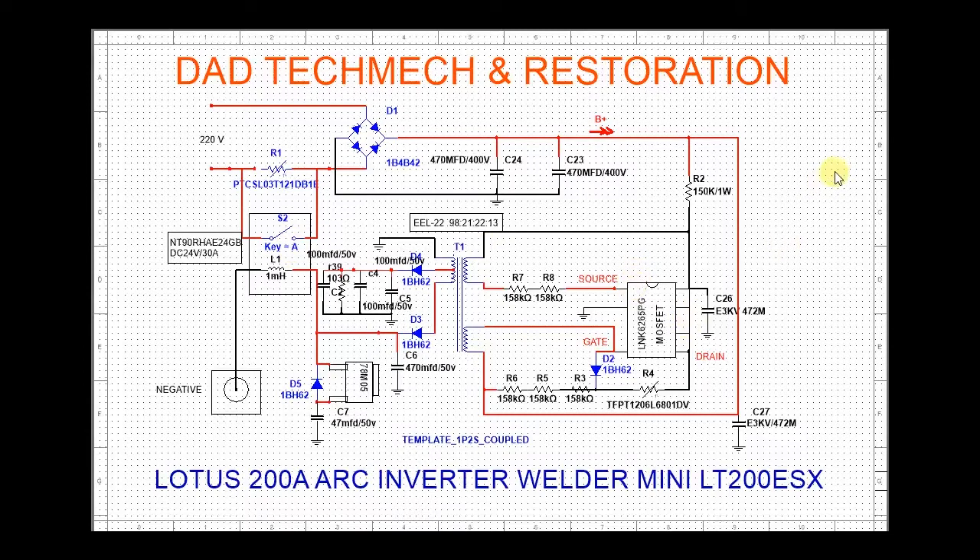This connection here is disconnected — it has no IGBT because I removed both of them. I ran the supply first just to test. So going back here — from the bridge rectifier, coming here, we get a supply of around 326V plus.